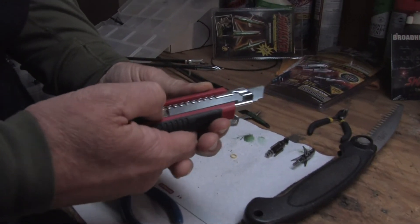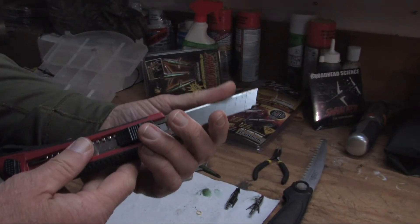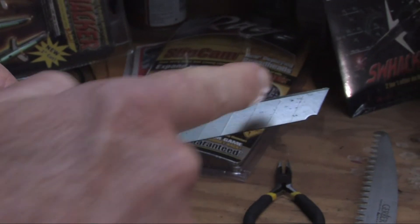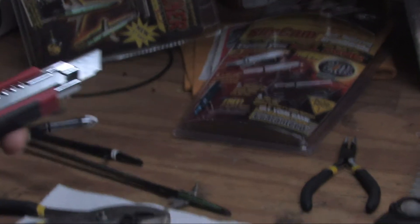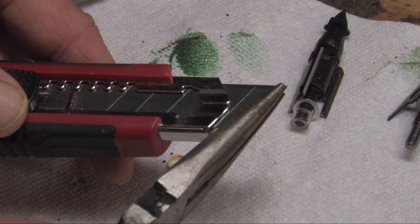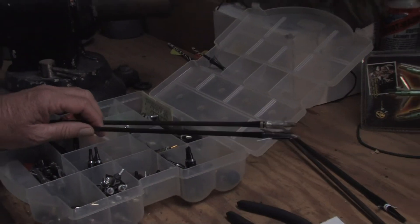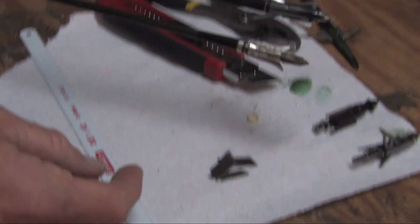This is my utility knife — you probably have one like this. This utility knife's blades are made with a strip grinding process; this edge is very sharp. This strip of steel is stamped with these little cutouts. Here's why it's stamped that way: after you use up one of these blades, you simply snap this blade off and you're down to the next one. This steel is so brittle it kind of resembles glass, but in order for it to snap off it has to be brittle. This is the cheapest and easiest way to make broadheads, but the blades end up being brittle.